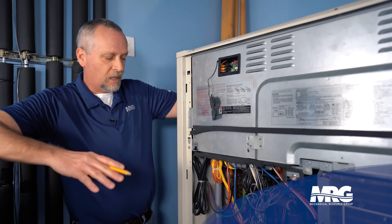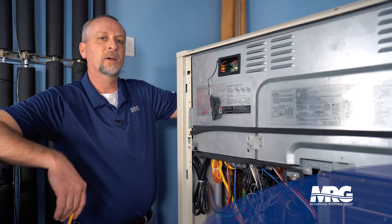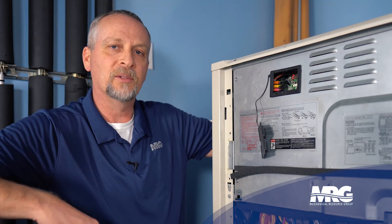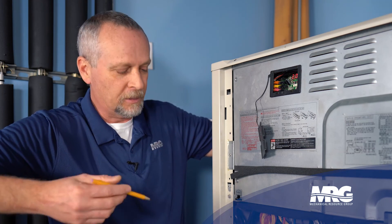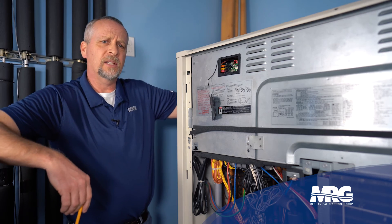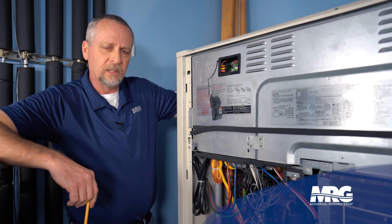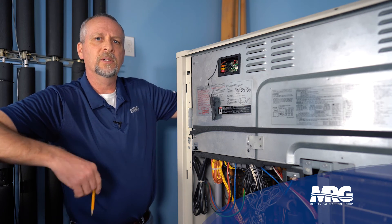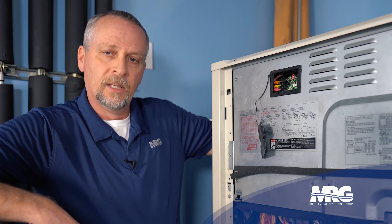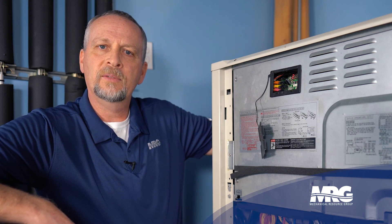Great feature, very cool. A lot of VRFs have this. Just be aware: if we go into emergency mode, we're going to get them up and running and be the hero — but if we don't let them know the risk involved, that other compressor will fail after a few months and it's not an equipment fault, it's just emergency mode left on too long. So be aware of the pros and cons of that mode. It'll definitely get your customer back up and running and they'll love you for it — just relay all the information and get that repair scheduled. That's all I've got today on emergency mode settings. We're going to make some other videos on VRV coming soon, so keep an eye out and let us know if you have any other suggestions.